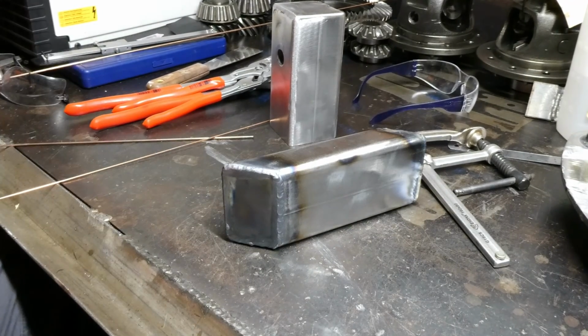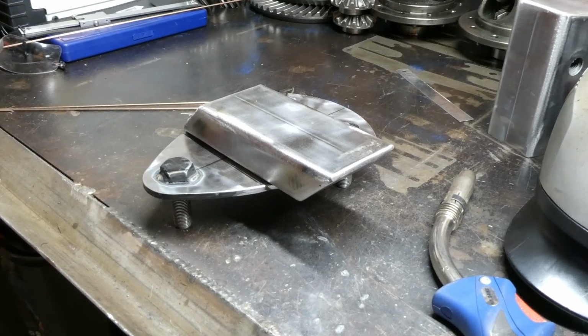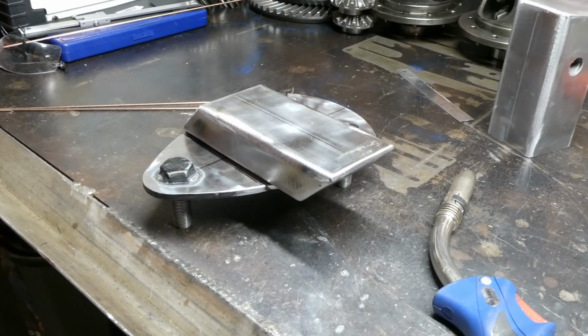That'll do. Alright, so we've got the part ready to weld out. We're going to use the dirty MIG on this one. Got the machine set up to, what do we got? About 120 amps, 26 volts, 10 meters per minute wire. This is the pulsed feature of the Pico 180, so yeah, ready to rock and roll.